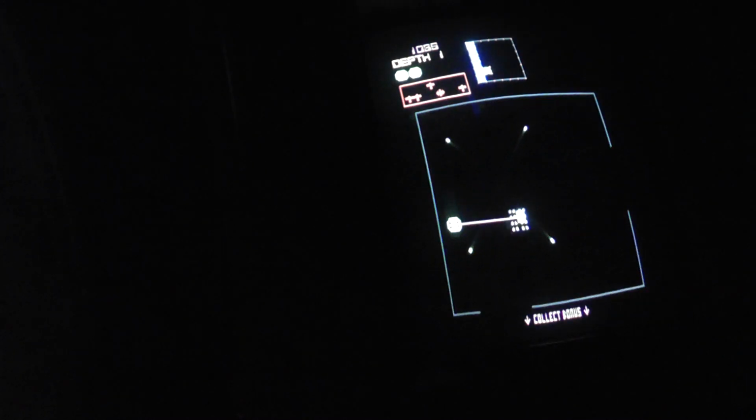And I also had some interference, because a lot of times with the monitors, if you have a switching power supply in there, if you don't tie field ground and logic ground on the power supply together, you'll get this interference here. That's mostly because on a lot of these monitors, the field ground and logic ground are tied together. So there's some type of variance between logic ground and field ground that causes the switcher to misbehave. So it had a lot of interference. Not a lot, but it was very faint. And now you can actually see the background.